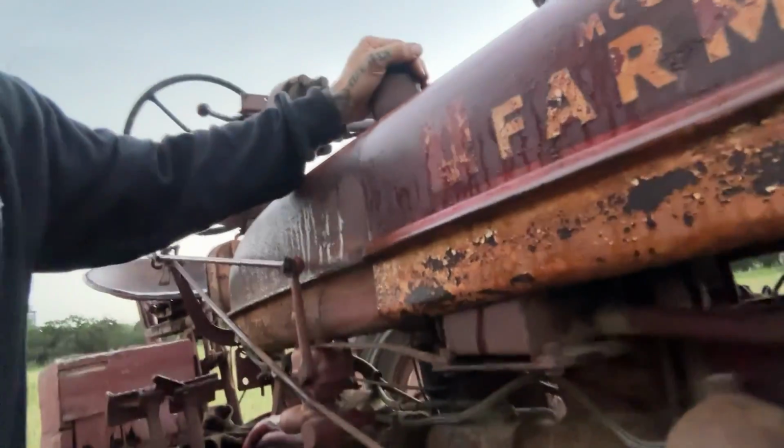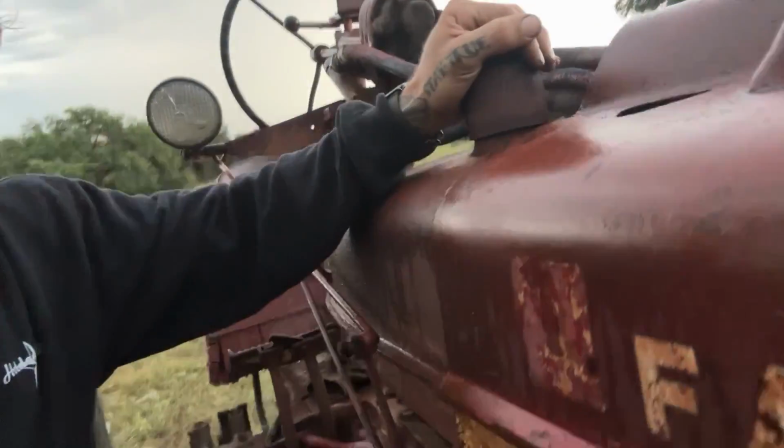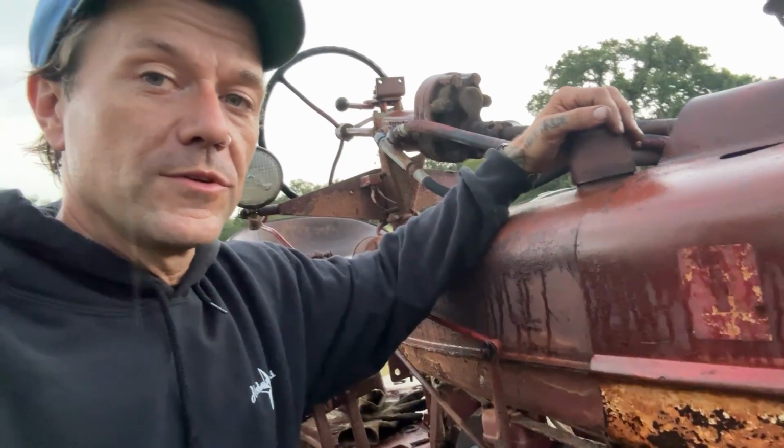So this tractor though cannot have one of those tanks because the Belin hydraulic tank is in the way. So that's what's using up the space for the starter tank, and I'm not mad about it. The power steering on these tractors, especially the aftermarket add-ons, did not use the hydraulic fluid from the tractor's actual system, even though you could plumb them like that if you wanted to, but this one did not.